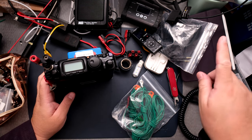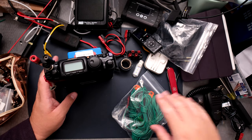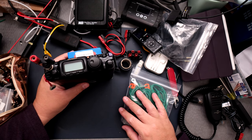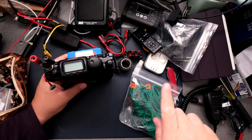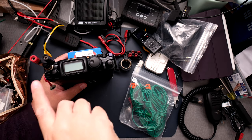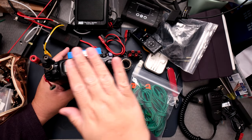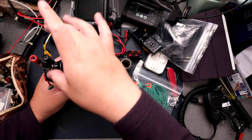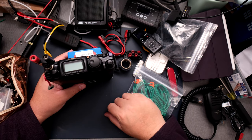Then you get your other wire that shouldn't be on the floor, should be somehow horizontal, maybe on top of a bush or on top of a rock. There's different ways. And that's your 20 meter antenna. Because on a dipole, you need two radiating elements. But we're doing an L shape, so you have one that's radiating up and down, and the other one, I'm guessing it's also radiating too, but it's more like a ground plane going flat. If you put the wire on the floor, it might not work as well. You could put maybe three or four more radials in the ground, and that might work okay.